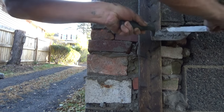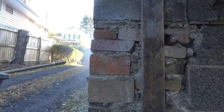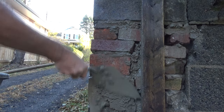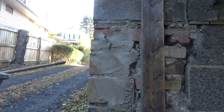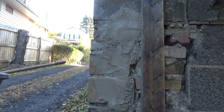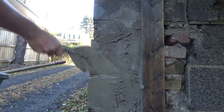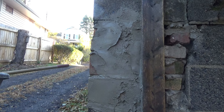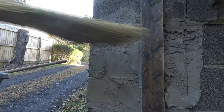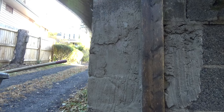See that? Now, I'm just gonna plaster this up a little bit. Wet it up like that. And we're gonna plaster it. See that? So now, just gonna scratch it because we're gonna go over it again. Just gonna scratch it, that's all we're doing.